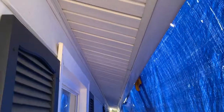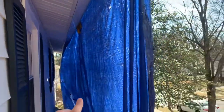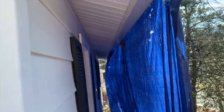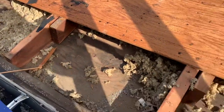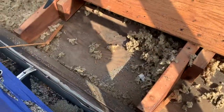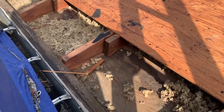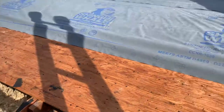I want to show you something that's really common with soffit and unfortunately it's a problem. Take a look at this — right here we have soffit and notice how it's vented because it's got holes in it, and there are sections of this all the way down. But when you go up top, look what happens — there's wood covering everything, which means the soffit isn't actually open. They just put it there for looks, or they didn't know what they were doing. Either way, air is not getting up in here and it's not going to the ridge like it's supposed to.